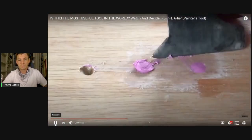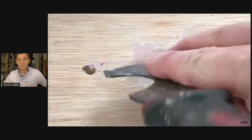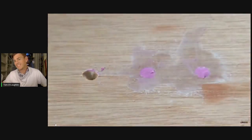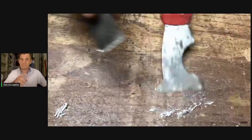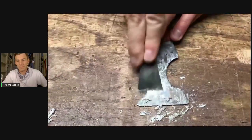You can use it to trowel spackle, wood filler, or even Bondo. The wide blade creates a lot of surface area, and the sharp edge gives you a fine, sturdy point of control. Just remember to clean the tool off before going on to use it for other things. Some harder wood fillers like Bondo can really gunk it up. So those are pretty much all the paint-related uses.